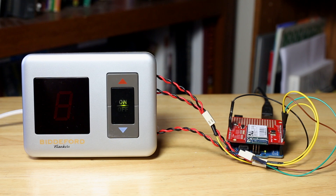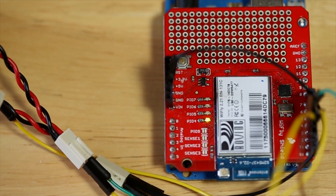The other side of this project is the web interface. I chose an Arduino Uno and the Wi-Fly Shield from SparkFun to act as my portal from my room out into the rest of the world via the internet. I will also be going over how I set that up — both the settings on the Wi-Fly Shield itself, the code, and describing how to port that outside of your home wireless network so you can access it from anywhere in the world. Here we have my prototype: on the left we have the Biddeford digital controller and on the right we have the Arduino board hooked up to the Wi-Fly Shield.